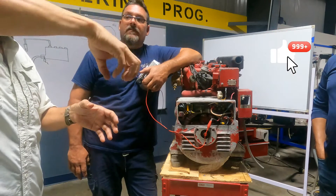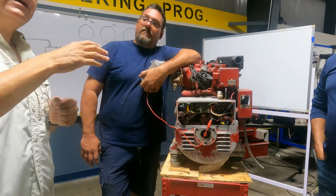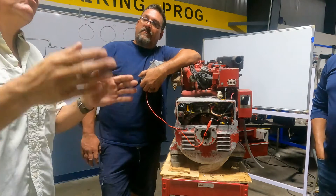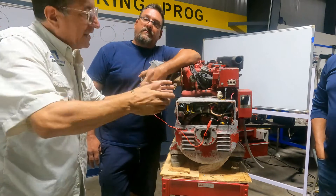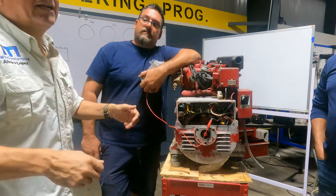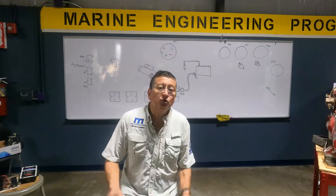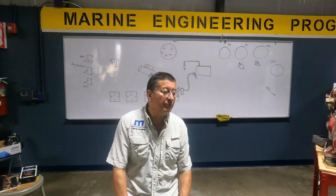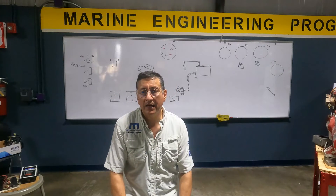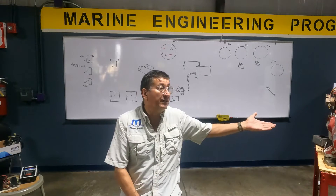The helicopter lifted and brought it to Miami. I waited one week. They returned the back end and once again I connected all those wires and started the generator again. This is when I have a suspicion that both phases are too low — for example, one phase produces 30 volts AC and the other 50 volts AC. You check with the megohmmeter and this is the consequence.